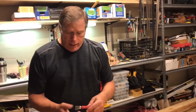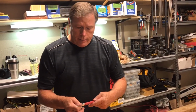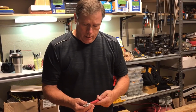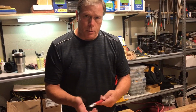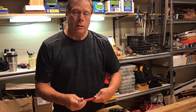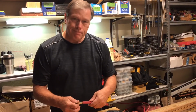I can't argue with that, but at the same time, I think for us in this application, having this exposed a little bit is probably best for heat dissipation, since this mobile generator might be used in a hot environment as it is. So, I'm also using older batteries, as you know. They tend to be a little persnickety, and they can build up heat as they're charged. So that's what I'm doing.